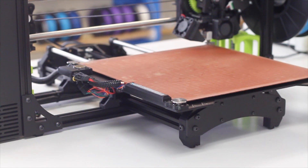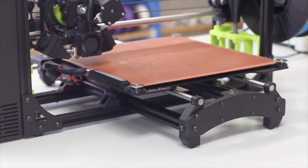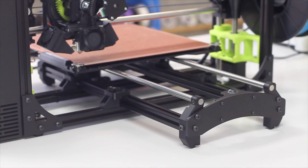This sequence is initiated each time you start a print. It takes about a minute and a half, so you have to add that to each of your print times. Now it's finished, and in the firmware it's now found what zero is on the bed — it's interpolated all those points to find what zero is, so that your first layer is really uniform throughout the whole thing.